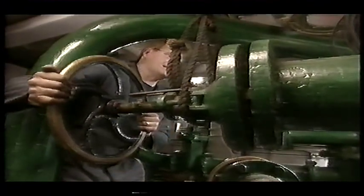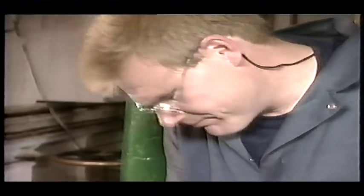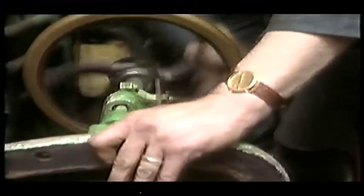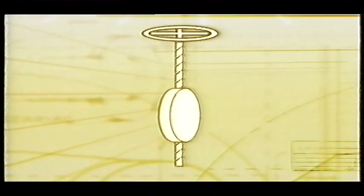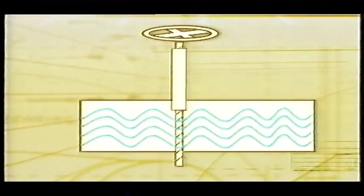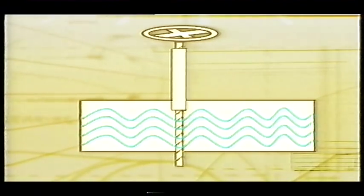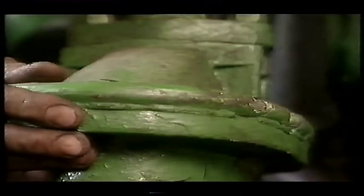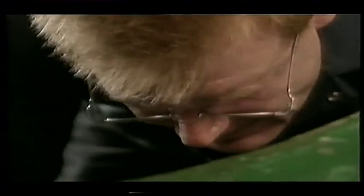Hence the need for Jerry's strip down, but on first inspection the valve seemed to be fine. All I can see is a gate valve. Gate valves are a kind of tap — the gate itself is a flat disk of metal mounted on a threaded shaft. When the wheel is turned at the top, the gate travels up and down the shaft just like a nut going up and down a bolt, opening or closing the valve just like a giant gate.